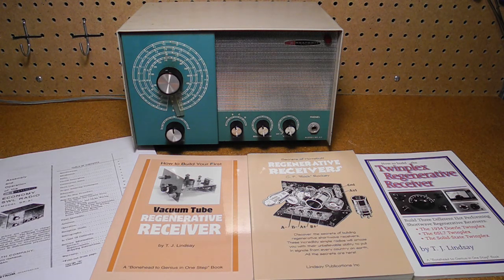If the gain is too high, the circuit oscillates, so a regeneration control is provided to adjust the level of feedback. Typically, feedback is performed using a small coil in the tuning circuit called a tickler coil, with regeneration controlled by a variable capacitor or resistor. For receiving amplitude-modulated signals, the receiver is most sensitive when the regeneration level is adjusted to just below the level where it oscillates. CW Morse code and single sideband signals can be received by increasing the regeneration until the circuit oscillates, which acts as a beat frequency oscillator that mixes with the input signal so it can be heard.